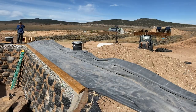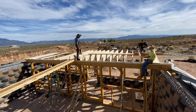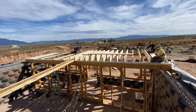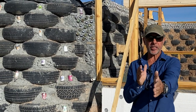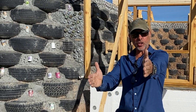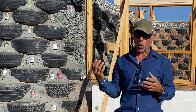After that sandwich plate is screwed back down, we're ready to lay out our TJIs — same thing, 27 of them, 16 inches on center. I've redesigned this simple survival frame roof. Typically you might do vigas, rough-sawn nominal lumber, or a different type of truss, but I chose to go with the TJI because I like the insulation detail. We'll start with a TJI right in the middle of the house, put one on either side, and as we get that first TJI mounted we'll cut poly-iso insulation into strips.